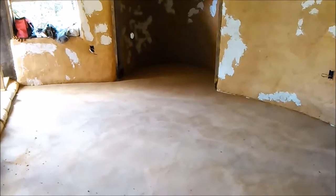Today is August 17th and we got the earthen floor done for our bedroom and walk-in closet. There will be a step down into this room, so we're going to do this edge of exposed bags here. This took us about three days of work — Craig and Tasha were over today helping us. It's coming nicely and it seems like it's going to be a really good floor. This is cement stabilized earth: one part cement, ten parts dirt, and some fistfuls of cellulose for fiber.